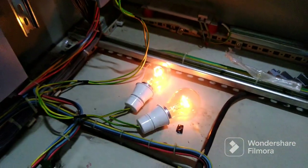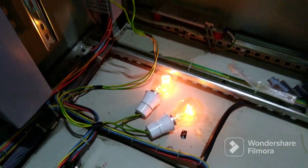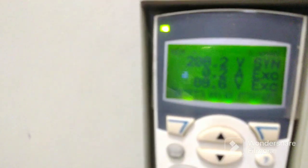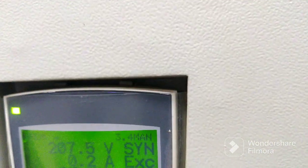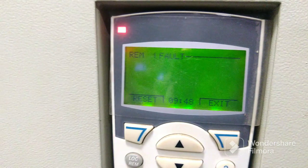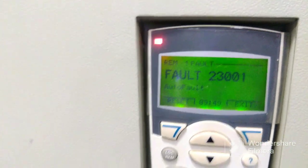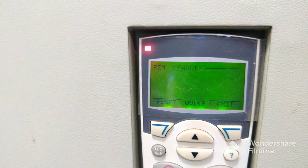Now you can see the brightness of the generator. The set point is 155V. Now you can see the generator voltage is not coming — that's why the closed loop feedback is missing. That's why it is automatically degraded from the firing.